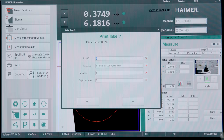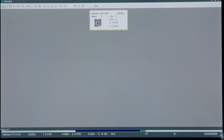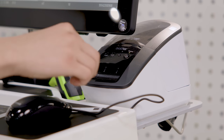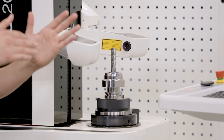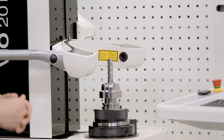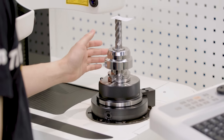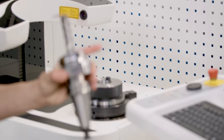Now that it's all done we can take our data and actually make it into a G-code file for our machine to use. We've gone through and taught our presetter how to move to find the exact measurements that we want, which is very powerful when you combine it with the automation of our next thing — the tool kit.